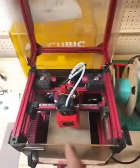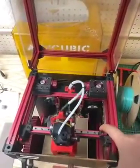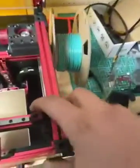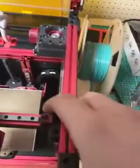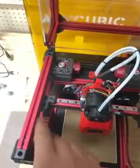The other kind of racking you can get is belt induced. To check both is basically the same thing. You'd bring it to the front and you hold one side and then you see if the other side bounces, right? So what would happen is it would go bounce, you'd hit it and it bounced back. If you have that without the belts on, you're mechanically racked.